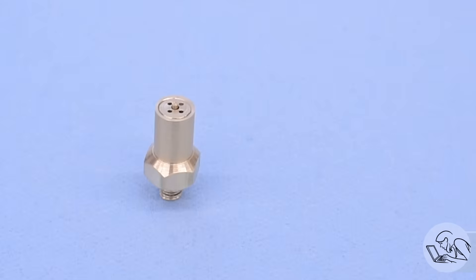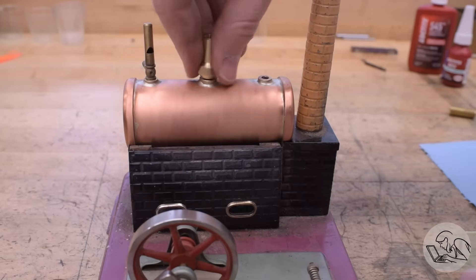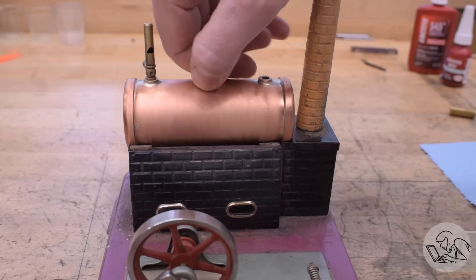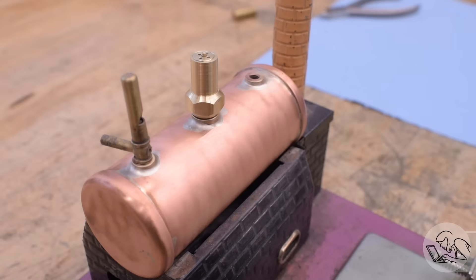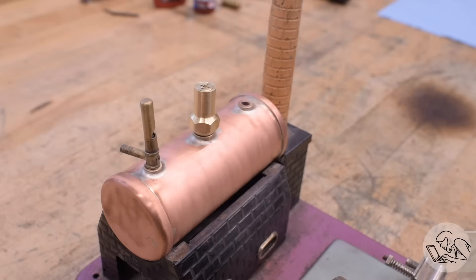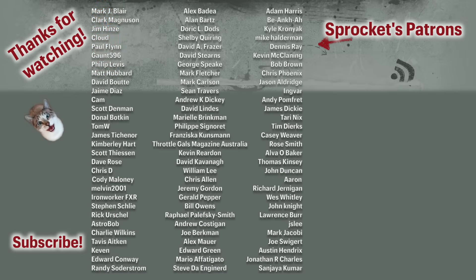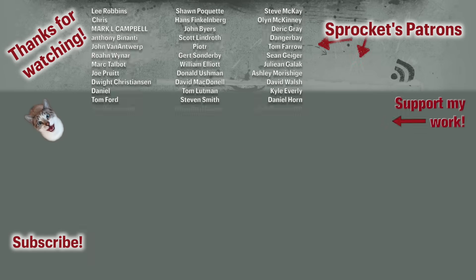There's my little safety valve, built to someone else's design — hopefully that means it'll work. It seemed to work pretty well on compressed air, so I'm feeling pretty good about it. Let's get that installed on the boiler and see if it looks the part. I'm pretty pleased with the size of it — it came out smaller than the whistle so it seems reasonably in scale for this tiny little boiler. I'd say that looks pretty good on there. It's certainly more sophisticated than the factory safety valve, which I think was just a check valve with a spring on it. This one should perform a little bit better — but we won't really know until we test it on live steam, which will be coming up in a future video. Thank you so much for watching; I hope you learned something interesting about steam safety valves. Thanks to my patrons for making all this happen, and I'll see you next time.